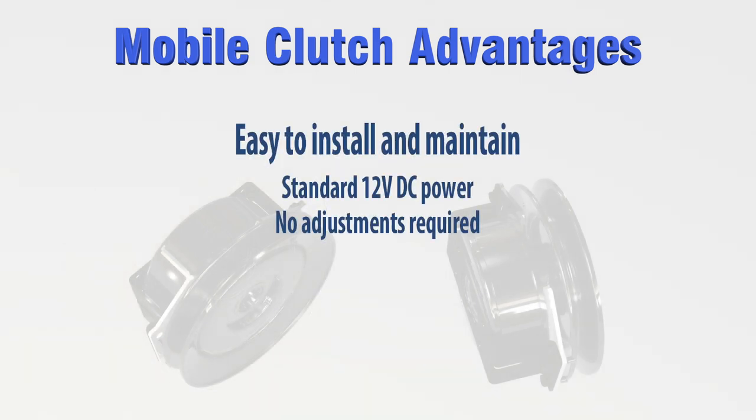Installation is very simple. Most PTO clutches are one piece that easily slides onto the engine shaft. Power for the clutch can come right off the 12-volt battery, and there are no adjustments required on installation. However, all units have some adjustment for wear that helps increase cycle life and save money on replacement cost.